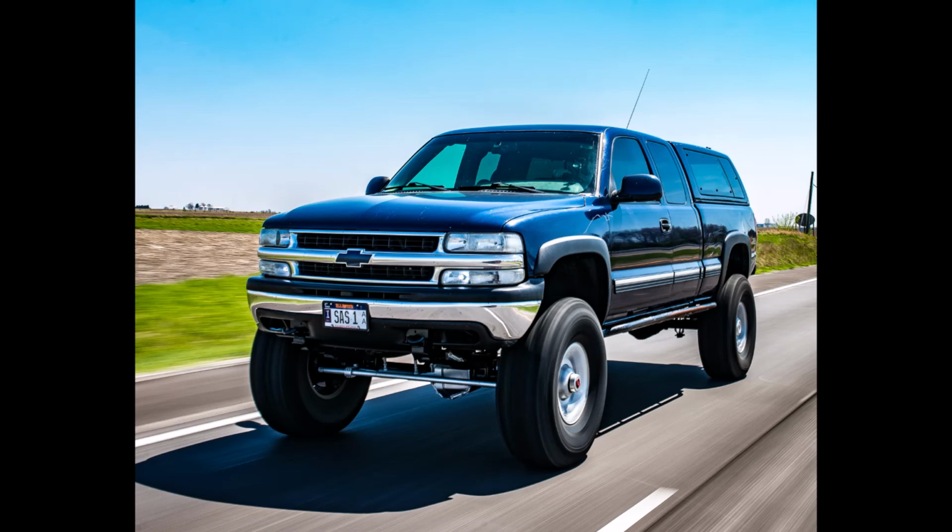Did you do it with what wire size? 30. Oh, 30? No, 030. Wow. It welds just fine. Next time, well, it probably welds fine, but try 024. 024 would have been nice. Yeah, that's what I do on my exhaust, because I'm so tired of burning through.